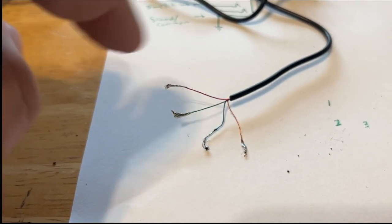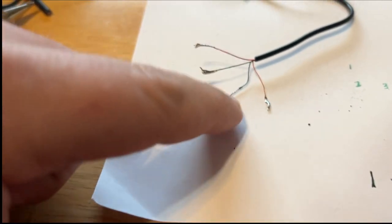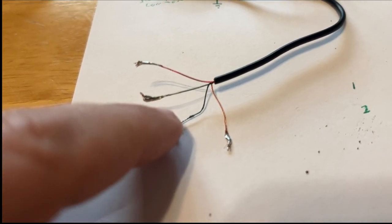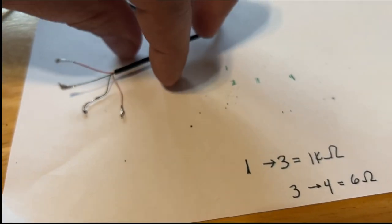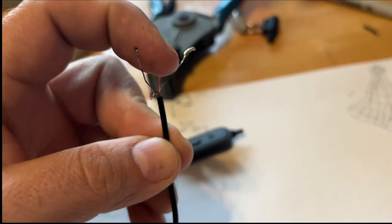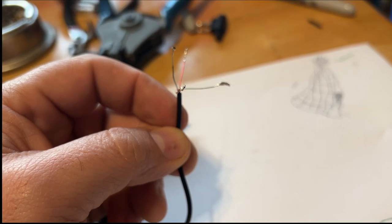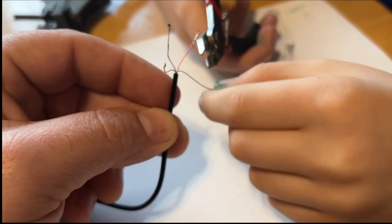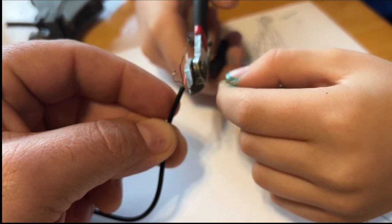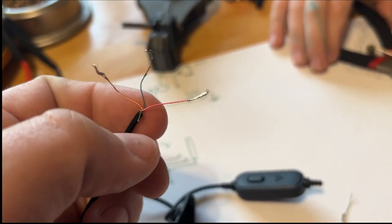We are going to delete number 2. So I just splayed them out like this because I can't tell the colors of these wires. I'm colorblind. I know that one's very blue-like. So pin 3 is your common. So, I mean, naturally, I guess whatever color that is your common. So I won't miss that one. We're gonna delete this one from the circuit. And Oliver, time to cut. So more cuttage. He is going to trim this one off. So be very careful. Get those side cutters right there, the nippy snippies. Yep. And trim. Hold on, let me focus. Yep, trim that one as close to that as you can get. Green wire. Okay, yep. So we got rid of that. We'll just fold that out of the way with some heat shrink in a little bit. I can cut it if you want.